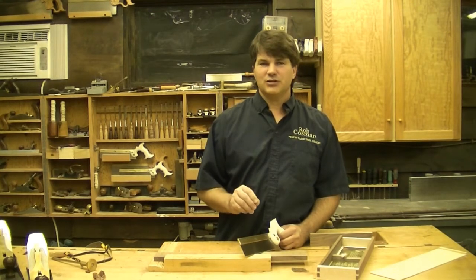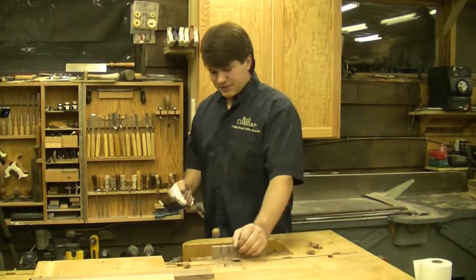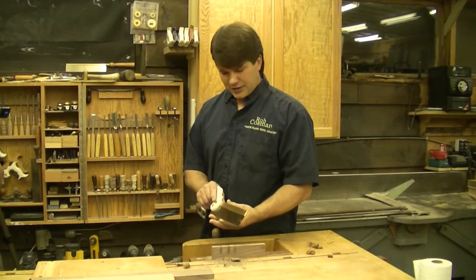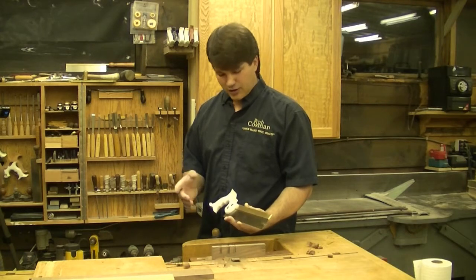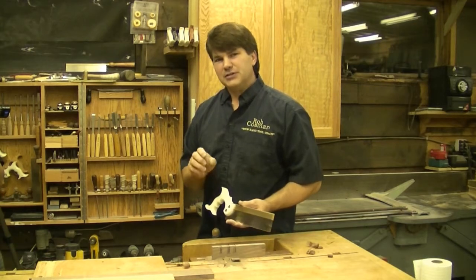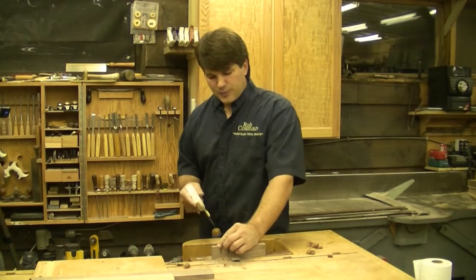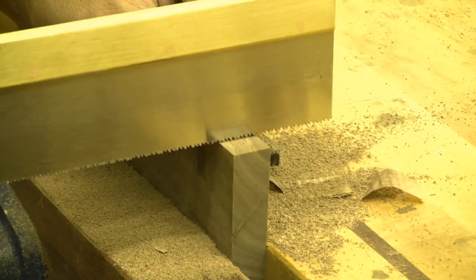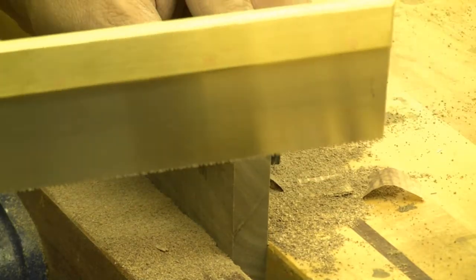Now that's the saw. Next I'm going to show you how well it works. Comfortable stance — everybody's a little bit different but you'll find what's comfortable for you. As for how to hold the saw, it's designed to be an open three-finger pistol grip. My index finger points down the length of the blade. How much force? About the same amount of effort you would use shaking hands with a child — very light. I use my opposite index finger and thumb as an anchor point and press the saw laterally against them. This gives a very accurate start and prevents the blade from wandering to one side or the other.